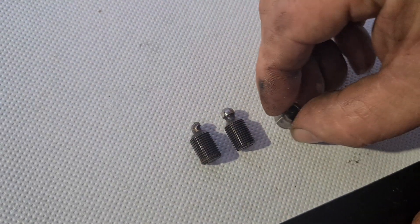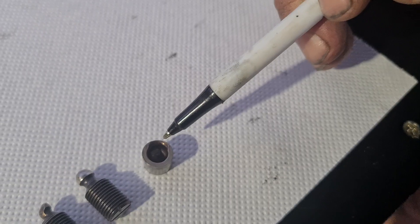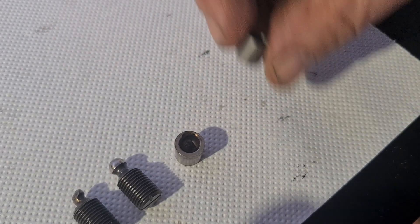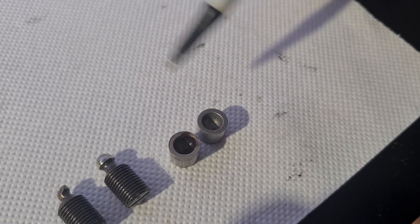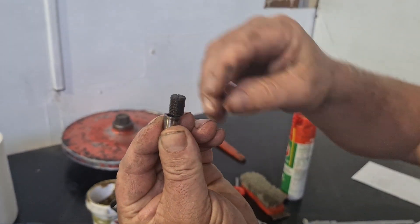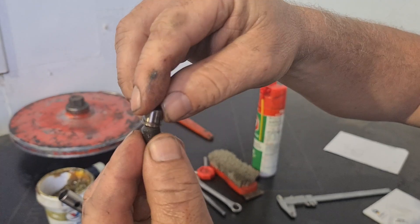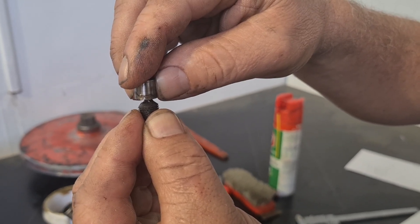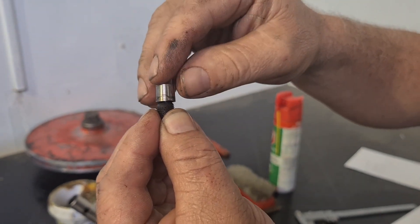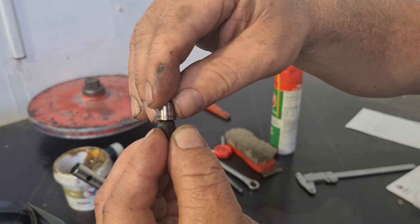So then we also have the cup. Have a look in here — you can see a massive turn-around, it's really worn out in there. Put the new one next to it — this part's missing that whole side compared to what the new one looks like. Now if we sit the worn one in the worn cup, you can see how it's sitting — it's just resting on it, instead of being up where it should be. It's chopped down and forward. So we've probably lost another three mil of height on our fork — the fork's dropped down. If our tension pin and sleeve is worn out, everything's dropped right down, our fork angle is way out of control, and we're never going to get a cut.